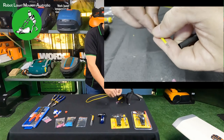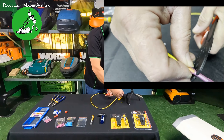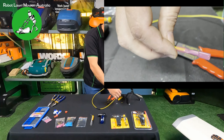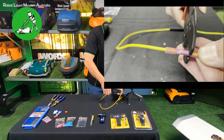After stripping both ends, first thing you want to do is put your heat shrink on - don't forget this step, it's easily missed. Slide it back down the wire and out of the way. Then slide your red crimp connector on, pushing the wire all the way through until the yellow reaches the middle marker. Using the small crimpers, because they're thin you'll need to clip two or three times. Do one side at a time - squeeze it down on the side with your wire, then put the other side in and push it until it seats without losing any strands.